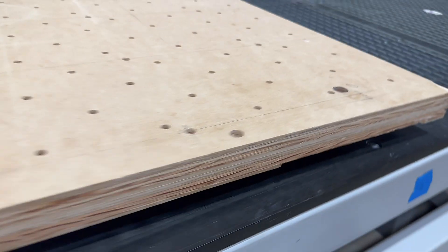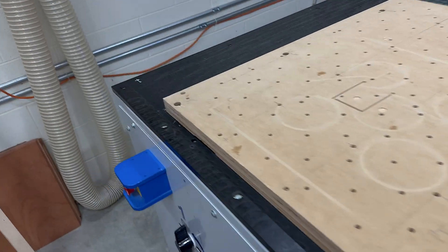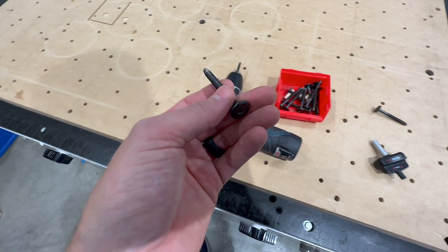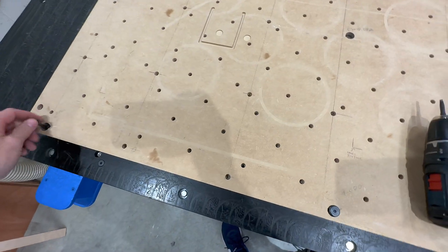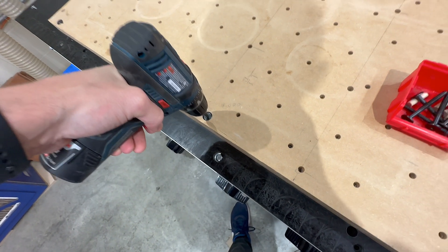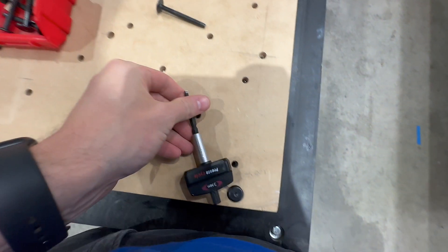I've got one side partially in over here, and then you just align the other end until it drops into that hole. Now your fixture should be about as repeatable as you're ever going to get on a machine like this. We take these quarter-20 cabinet fasteners, throw them in the holes to get them started, and then use a drill clutched down to about 10 — this little drill we use for everything.